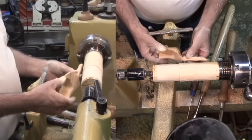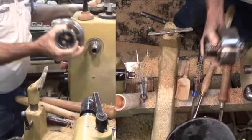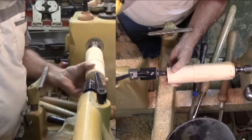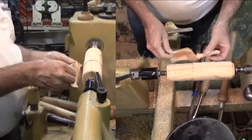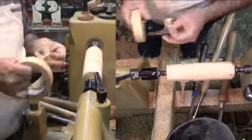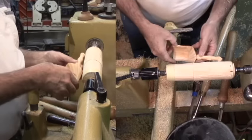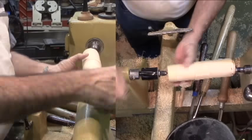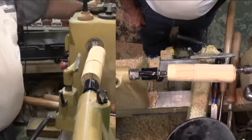Now I'll scratch my head to figure out which way to offset the turning axis. I could have offset the axis parallel to the old, but then the handle would come out straight from the scoop. Instead, I'm offsetting both ends because I want the handle angled down to the scoop. This is the second turning axis. I'll remount the wood between centers, but angled a bit cockeyed. This is why I wanted that small disc fitted snugly in the scoop.